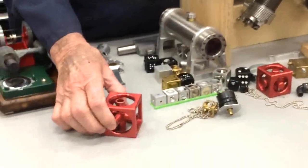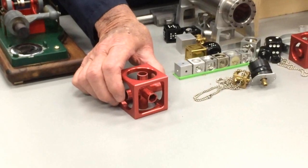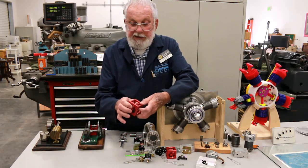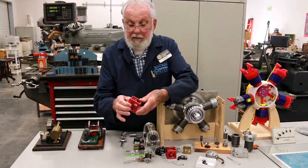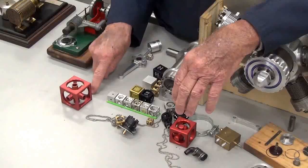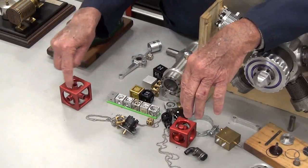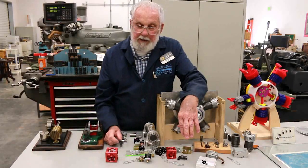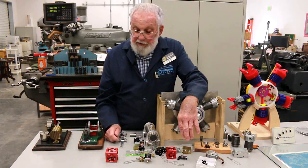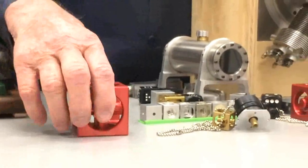Here's an example — this is called a jack-in-the-box or a jack-in-the-cube. I sat down and did my calculations because what I want to arrive at is to enable this jack to turn any which way inside this frame, but not come out. So what I do is machine five sides. I don't do the sixth face because that base material is holding onto the jack while I do all my machine work on each face. Then I fill the whole thing up with a very hard wax known as machinable wax, which is approximately the density of aluminum and melts at about 175 degrees. That holds onto the part while I do the sixth face.